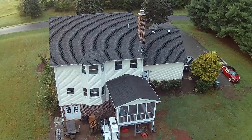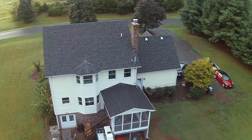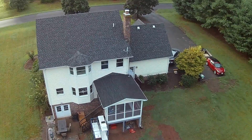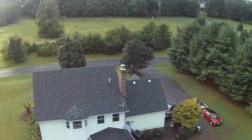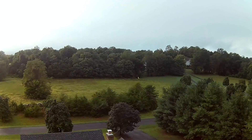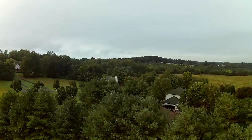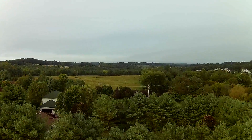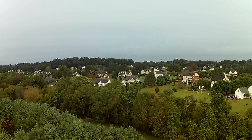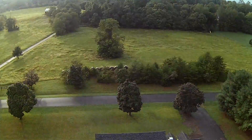Here I am at about 50 feet. There's a little too much jello in the picture — I've got some serious work to find out what's causing that. The gimbal is nicely sprung on the rubber ball but I've got a resonance in the frame right around the prop RPM and I'm not quite sure how to fix that. I've got the notch filter set right on the prop RPM and it did reduce the jello but didn't get rid of it, so I've obviously got some real mechanical problems. Here again I'm doing a much faster yaw using the 10% mix from a pot on the Taranis.